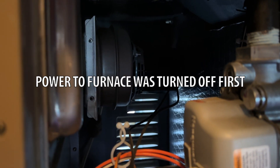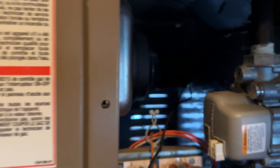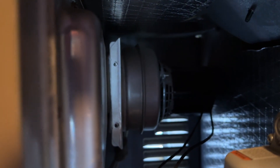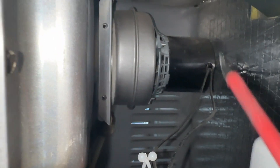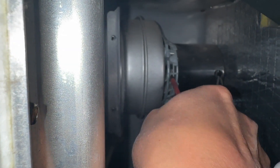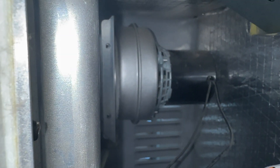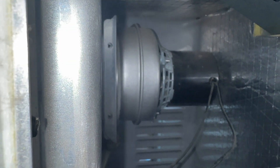What I did so far was disconnect the inducer motor and take out the two screws holding the motor onto the furnace. With some more light, I tried to spin the fan and it's locked up, so the fan has most likely gone bad. We'll diagnose the fan and see if we can get this running.